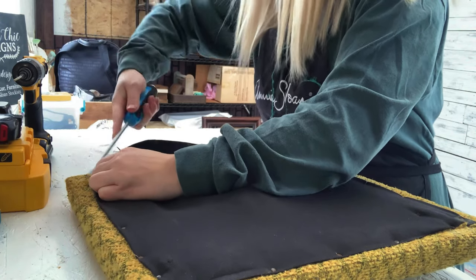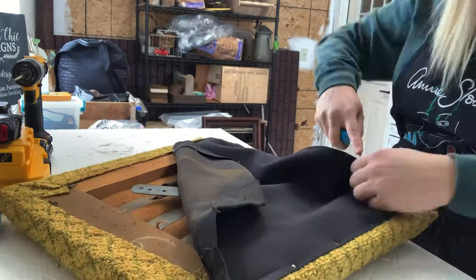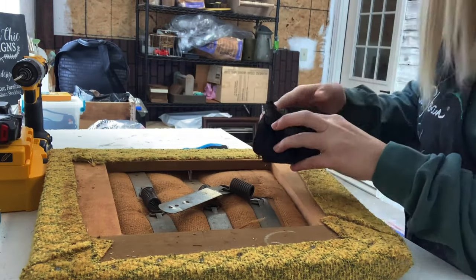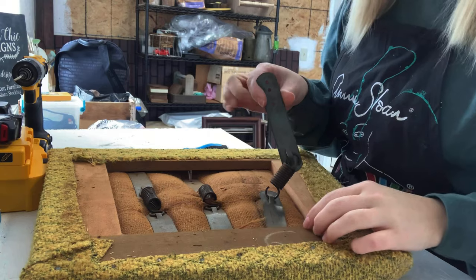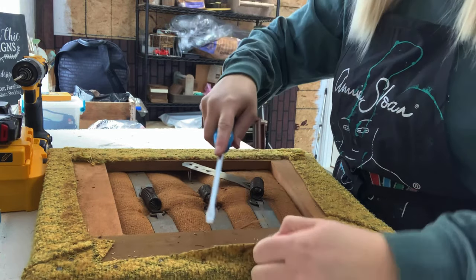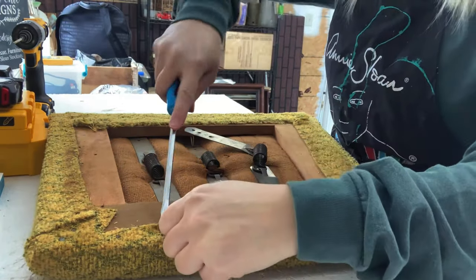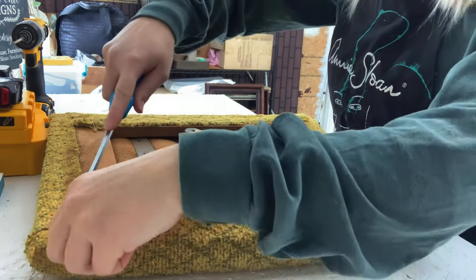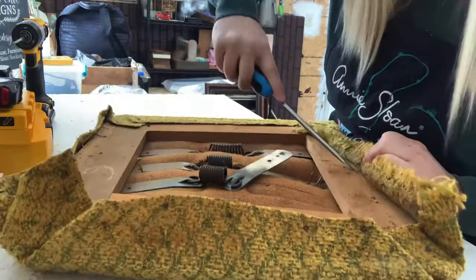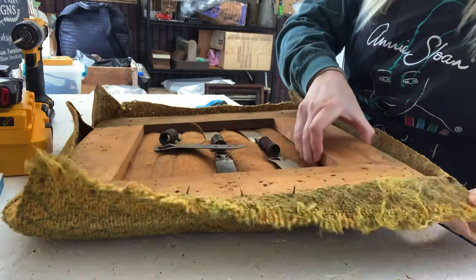So you'll figure out your rhythm, how each chair is different, how to pull it apart and everything. And I just work on top of the same fabric whenever I start pulling all of it off. I really want to make sure after I get this dust cover off that I pick up all the little tack nails and I throw them in the trash. I have a separate metal bucket for nails and screws and stuff, and I always throw that in there, or keep a trash bag by. Just make sure you don't have any of those nails running around after you're done with it, because it can get messy. But since this fabric is so dirty and nasty, I just worked right on top of itself, basically. And you'll see whenever I go to pull the burlap off, it has like a hay or straw type material under it, and yeah, it's filthy.